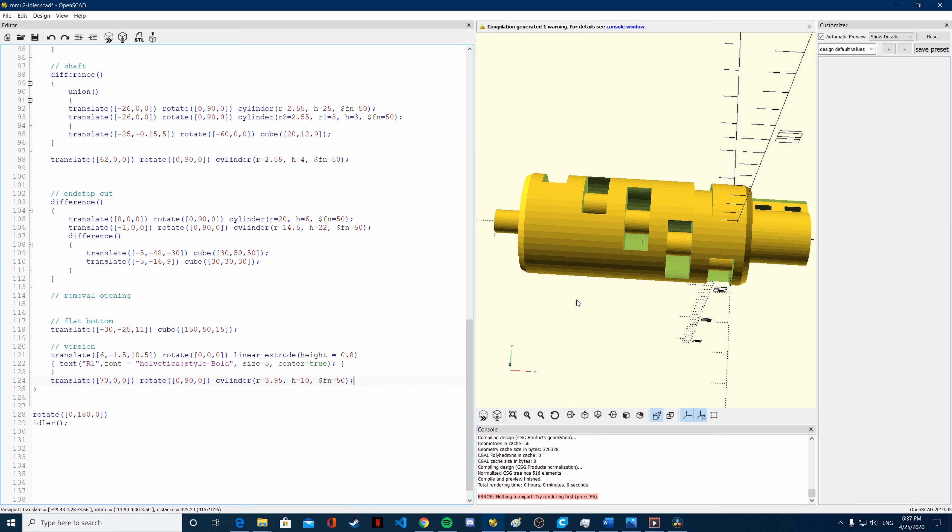Now that this is all done, you can render it and then convert it to an STL file. I will get back to you in the slicer — I'm using Cura, but you can do this in any other slicer — and show you exactly what you need to do in order for your printer to stop at a specific layer height, and also the print settings I recommend for this specific part with these specific modifications.